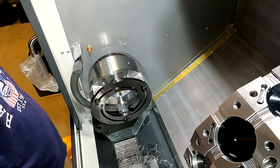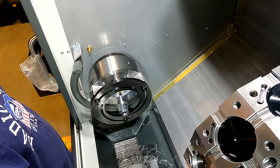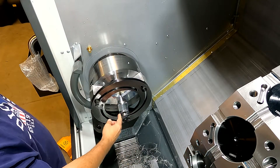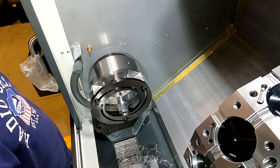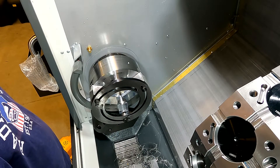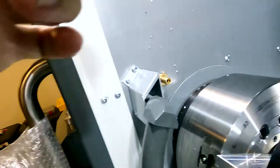So we can now bore at low RPM, up to about 900 RPM, with an insert suitable for an interrupted cut. And then we will have a better setup. Just so you can see close, there is that little mark — and we are in the sweet spot, right there.